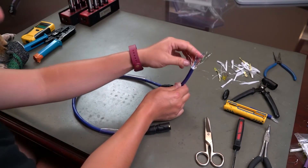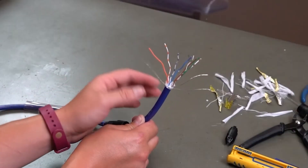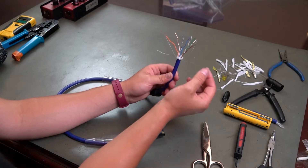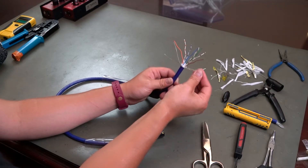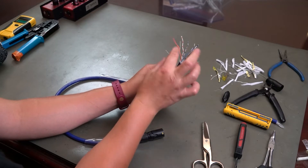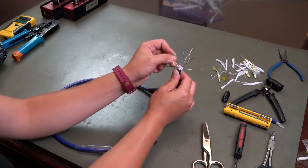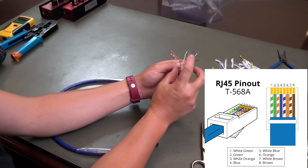Now we have what we would have gotten to so easily with the SuperCat cables — all of our wires exposed. The big difference here is that instead of just one shield that we unbraided, we have these four little drain wires. This allows you to do a lot of things that other cables don't, which is really rad. Like the cattails — you can make them without doing all sorts of unnecessary big clunky stuff. Now we are back to just our basic standard RJ45 pattern that we use, which we'll probably have a link to in the description.